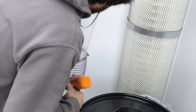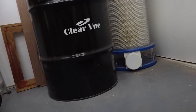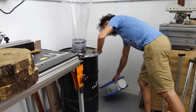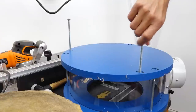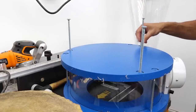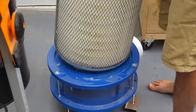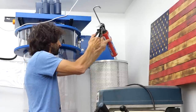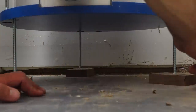I'll attach the flex hose between the cone and the drum and then move on to install the filters. My installation leaves about five inches of space between the filter stack and the filter transition. Rather than bridge the gap with some tube, I went with the easier option: the bottom of the clean-out has three leveling feet, and I swapped those with longer carriage bolts and made some walnut feet to make up the last little bit. I'll add a bit of silicone to the clean-out, drop the filter stack in place, and evenly raise the stack with the adjusters before securing it on top with a couple of screws.